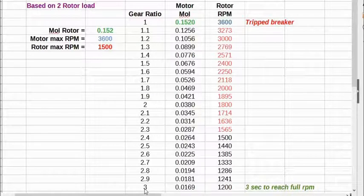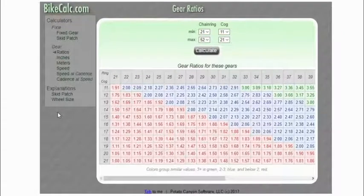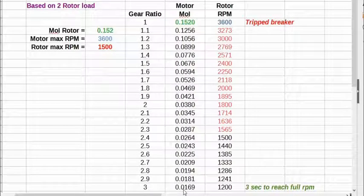What we can also do is use our 3-to-1 gear ratio and set the moment of inertia that Simple Dyno sees to 0.0169, by changing the roller mass value in the dyno setup so that what it calculates comes out to 0.0169. Something else I was thinking: we can use bicycle gears — chain ring and cog gears — to get different gear ratios. For right now, I'm going to put my 10-tooth gear back on and enter 0.0169 so Simple Dyno sees it as 0.0169, and then we'll take it from there.